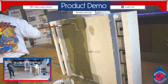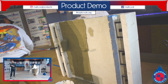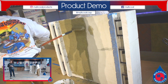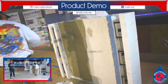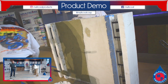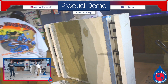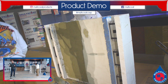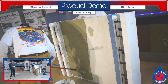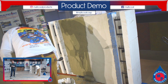Using scratch coat as a bond coat is a great way to save money for pool plasterers and get a better mechanical surface. The product is created to give you a better mechanical bite. When you use scratch coat as opposed to chipping, not only do you not have the cost of chipping, you don't do the damage to the pool, you don't have exposed rebar. With scratch coat, you also save probably at least 30% on your plaster or PebbleTech cost, yet your plaster and PebbleTech also have a better mechanical bite.